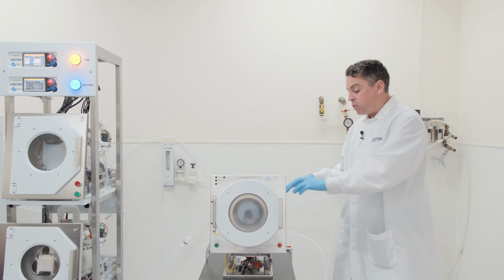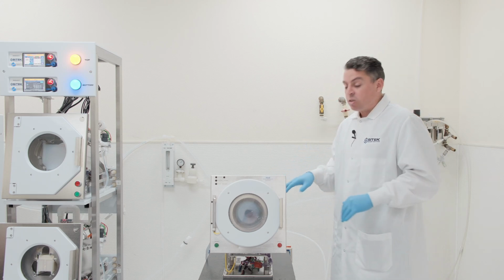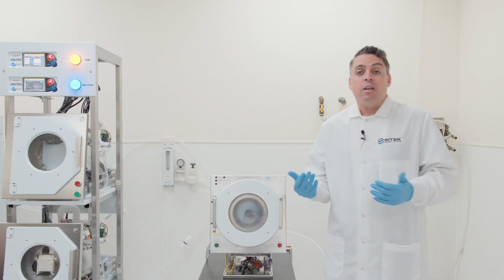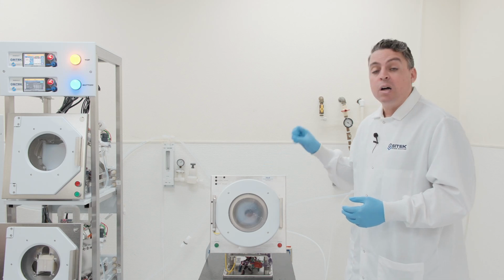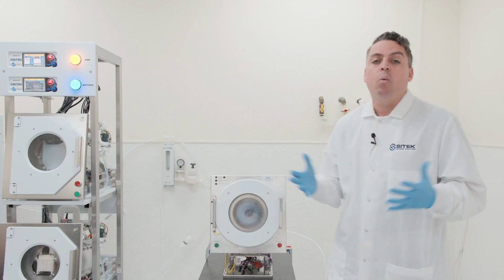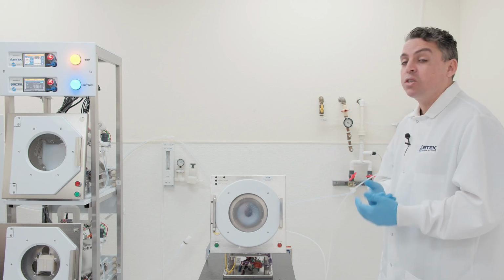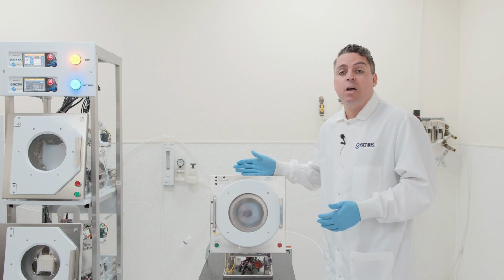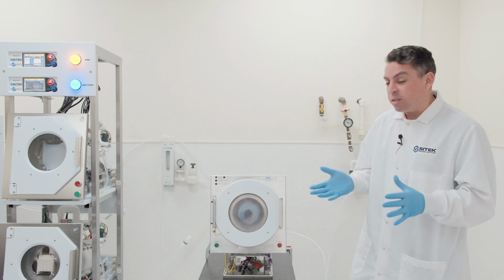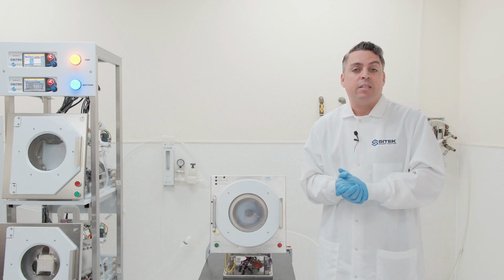And so that way, any residual water that might have been sitting in the manifold is going to be blasted out. So that way, during the dry process, none of the drips residual in the chamber will pull onto the cassette and substrates and cause any kind of water spotting. From there, we're going to go into our 2-stage dry. Right now, we're in our first stage dry, which is a high RPM dry step. We're going to be here for about 1 to 2 minutes, really kind of physically slinging the majority of the water off of the cassette and substrates.